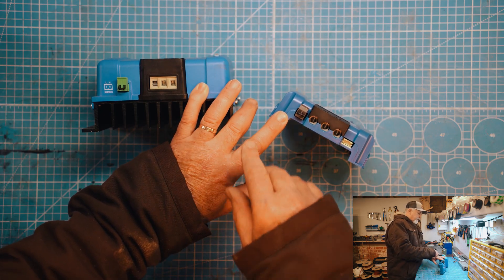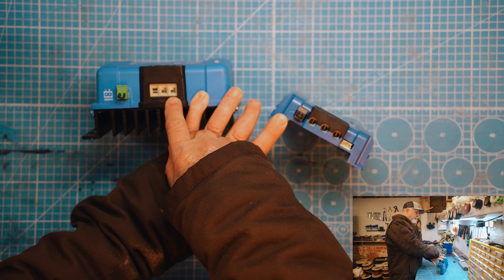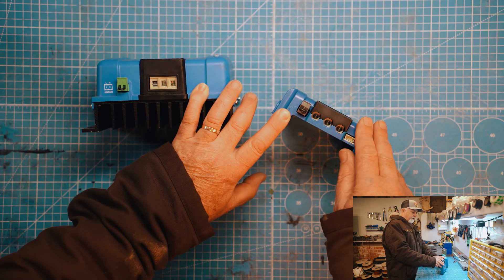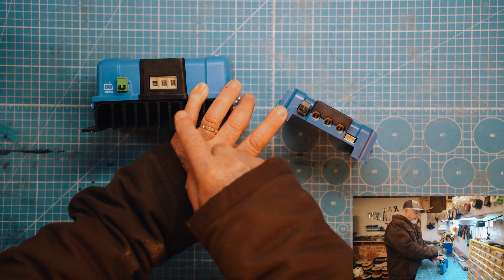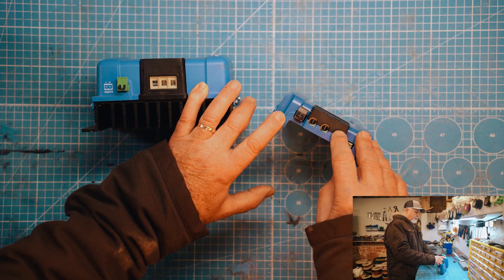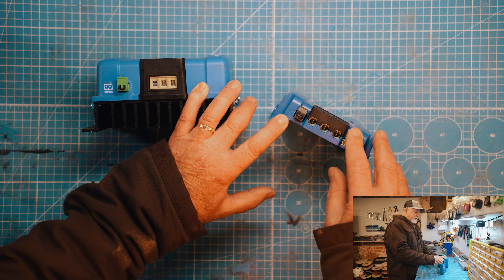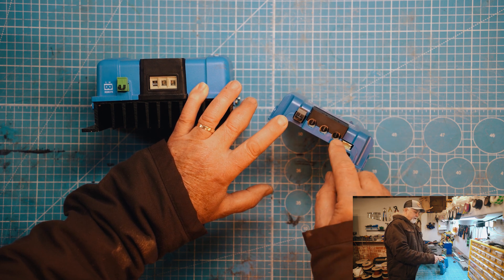In terms of connectors, these have the old square-shaped connectors where you would typically use a 16mm cable with a ferrule on it, get a square crimper to go with the ferrule, and this then fits in nice and snug. That works pretty well. The new XS, according to the spec sheet, takes a 25mm cable. It's got a different connector — completely round with a little screw that goes down onto the cable, so you'll probably get a really good connection. We'll be trying it out to see what size ferrules you can put in — you would use a hex crimper rather than a square ferrule crimper.